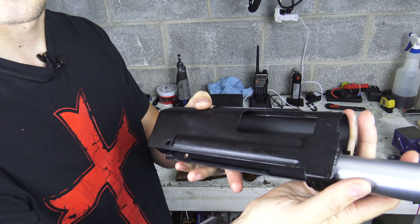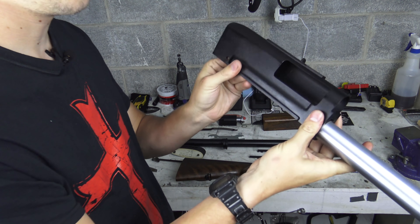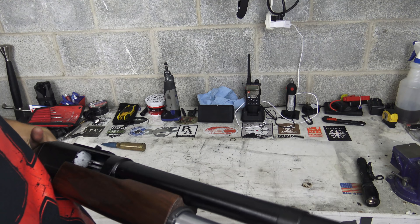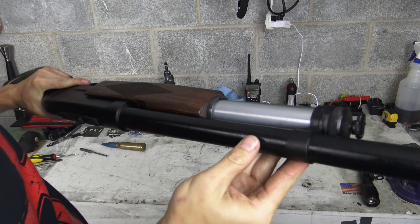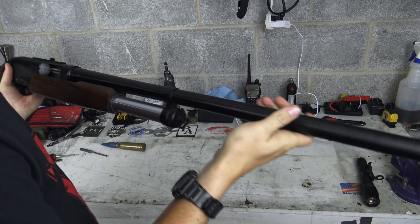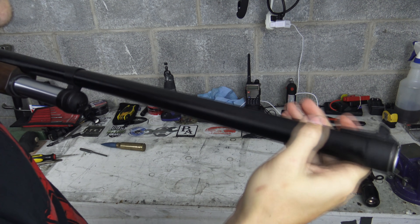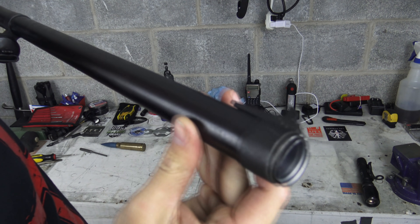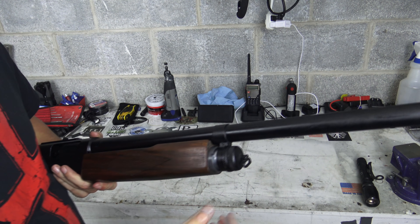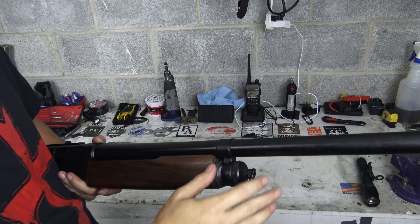Here's your bare receiver — just one piece of what looks to be stamped metal, and that's it. The locking ring is just pressed on and then pinned on, right through a hole drilled through the barrel. If you're familiar with AK building, it's kind of like that. Up at the front you have the same sort of arrangement — a ring with the front sight dovetailed into that assembly, pressed onto the barrel and drilled and pinned on the very end. Which is convenient because that means if you wanted to SBS this thing and make it look like an actual KS-23, all you'd have to do is press that pin out, press this a little further down, re-drill it and re-pin it and you'd be good to go.